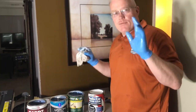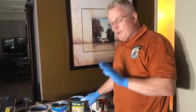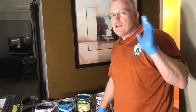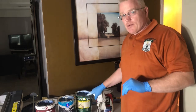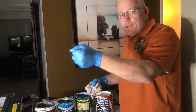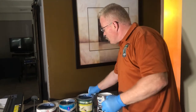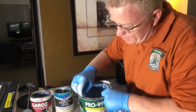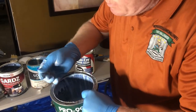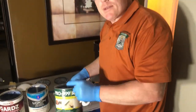If you're new and you're not sure, give it a day. Because if you move your paper off the wall and you only have this dry for two hours, it's going to come right off — it's not ready. If you're not new and you get it on the wall perfect, it all dries together. But take my word for it: if you're hanging shimmering wallpaper — something with a shine or sheen to it — and you try to pull the paper off the wall, think about bubble gum on a wall. You pull on it, it comes off like rubber. Same thing. Take a look at it in the rim of this container and you'll get an idea of what this stuff does when it's on the wall. It's like glue — it acts like a membrane.